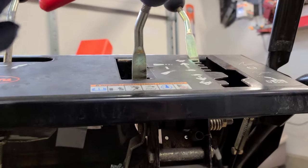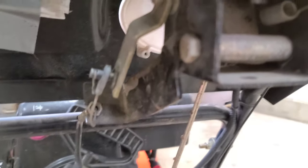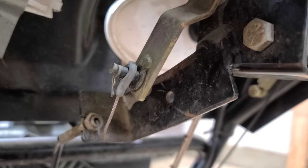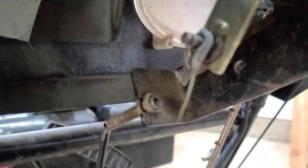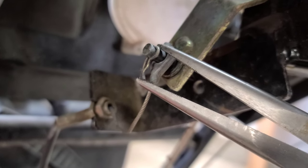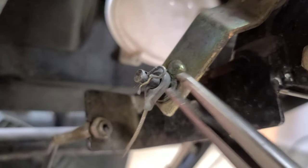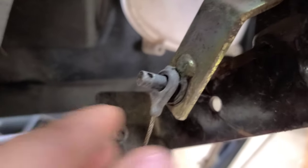Going on down to the back side — again, we are replacing the auger chute lever control directional control cable. There is the end piece there, the ring, and it's held on by a little cotter pin. So we're going to go ahead and get ourselves some pliers and remove that pin. It's pretty easy to remove a pin. I'm going to do this one-handed with a pair of needle nose pliers. Okay, I've got one side — just pull the rest out. And now you can simply take the ring off.